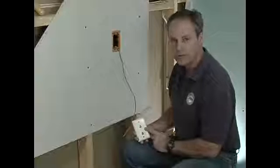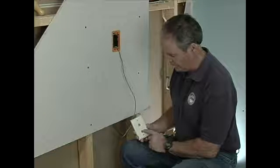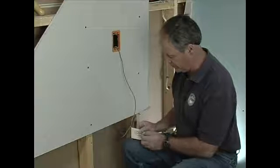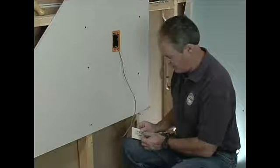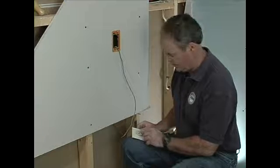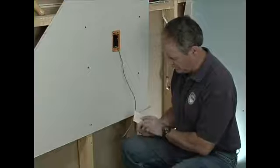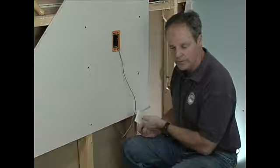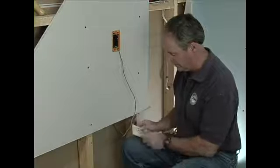Okay, we're going to install the jack plate now in the wall. So we have two receptacles. I'm just going to wire one for the demonstration. We've got a color code here. The red and the green is what you usually use if you're just connecting one. You can always look at it and see which, there's four little wires. You can decide which one the jack you're plugging in is using and connect to the appropriate one here.